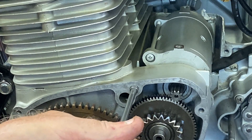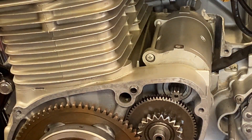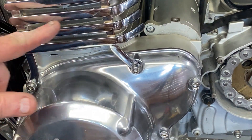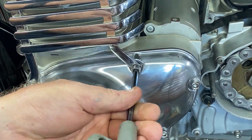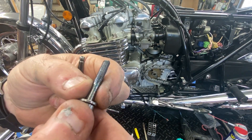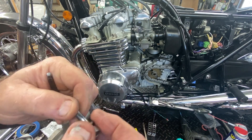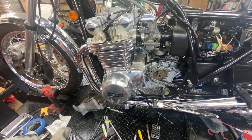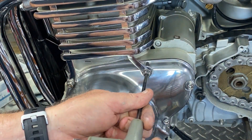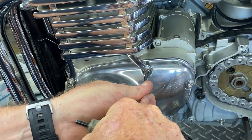It's not perfect but we should be able to get a torque on it and it'll work. He has lock washers on the other two bolts that hold this thing, so I'm putting those back on. Here's the bolt that came out of there - all I did was cut the bad end off and dress it up in the lathe. I also turned the shank down a little bit so it'll accommodate for that mismatch. Let's see what happens - oh yeah, nice and tight. Crisis averted.